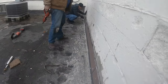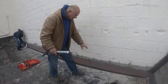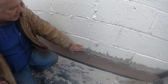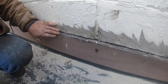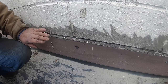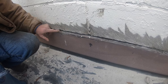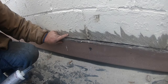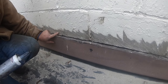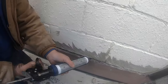The counter flashing is clean now — we ground off all the paint from the wall so we can do our flashing. I'm going to do two steps: I secured the metal, but I'm also going to fill the gap with a polyurethane caulk, and then after that I'm going to put a transition over this. This is a very secure way to do it.